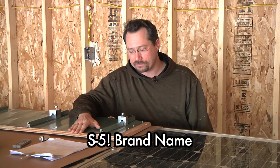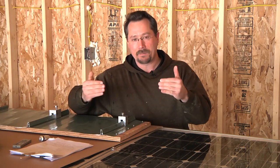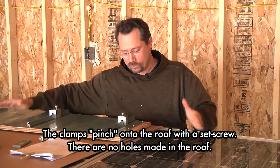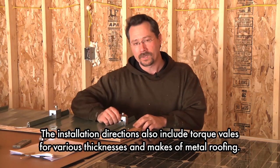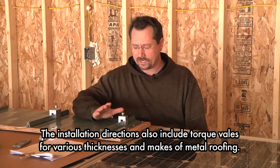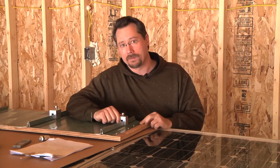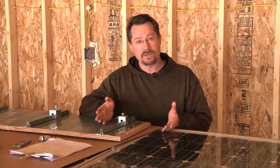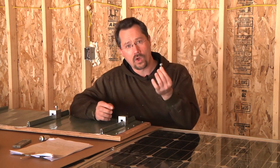I made up a mock-up of my metal roof. What I found is when I snapped two pieces of metal together and put the clamp on without it being screwed down, it kept tightening without torquing down properly — the metal was deforming. When it's actually on the roof screwed down it stays in place much better and the clamp is effective. I made a sample with a scrap of 5/8-inch plywood roof decking, screwed down some sample pieces of metal, put the S5 mini clamp on, and it works great — torques down really solid. I actually set it up on end, stood on the clamp, and jumped up and down on it. A 200-pound guy jumping on this one single little clamp doesn't budge at all — pretty impressive. I'll have these probably every four or five feet on the roof. The clamp itself is all aluminum and all the hardware is stainless steel.